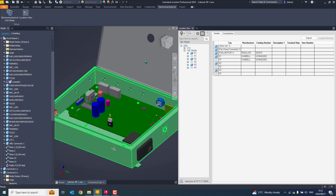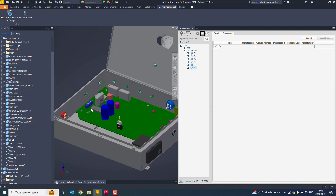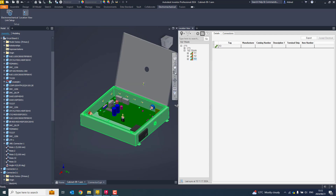Now, what we've got is we need to make sure that X1, X2, and X3 are connected to my X1, X2, and X3 components over here. So I select my electrical component, right-click, and assign to existing assembly. It then links it — you'll see a little green chain. But it's got a little red exclamation mark, which tells me there are some differences I need to sort out. Let's assign the remaining components and see what the discrepancy is — I think it's the pin numbers.